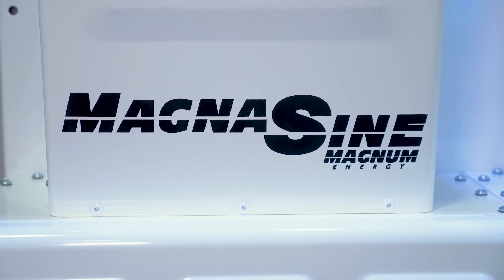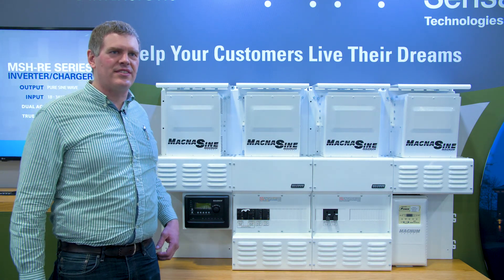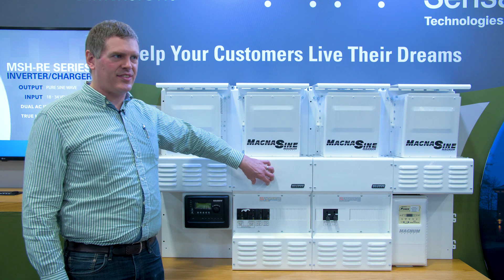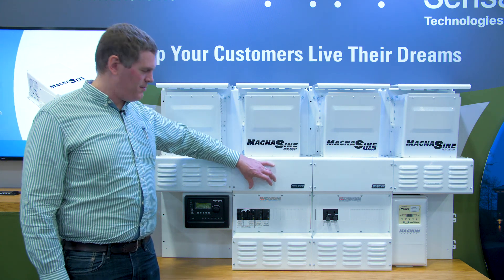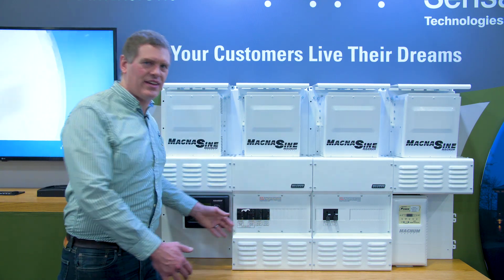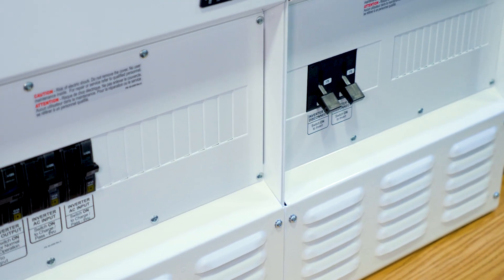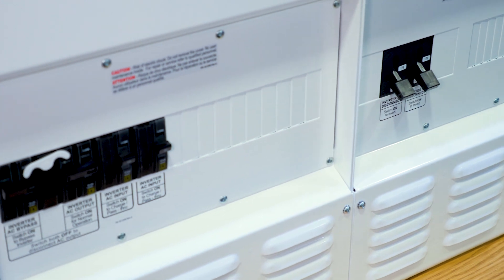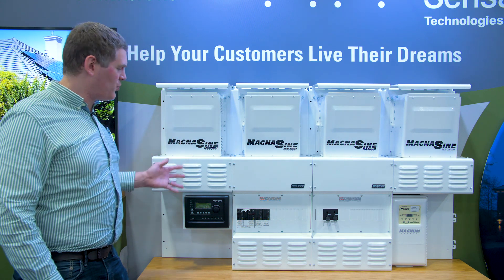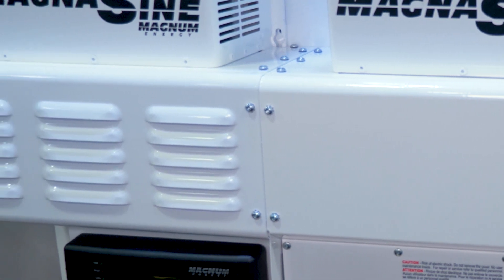For installing the system, if you think you'll expand in the future but don't need a full-size system immediately, you can start out with an MPSL, or single panel. That single MP panel has both AC and DC protection and interconnect integrated into one panel. In the future, if you wanted to expand to a second inverter and double the power, you could add an extension box, which comes with all the wiring and interconnects required to mate it to the MP.